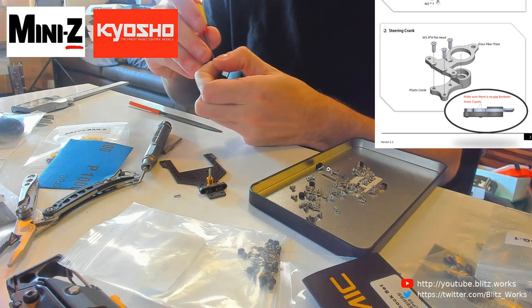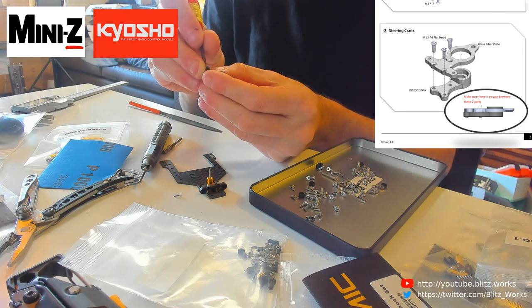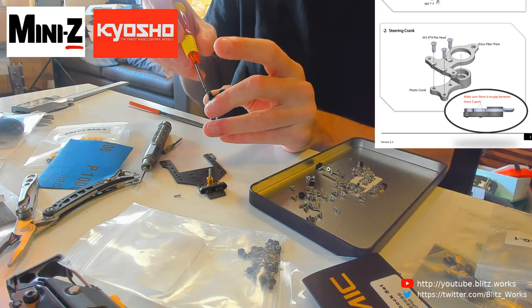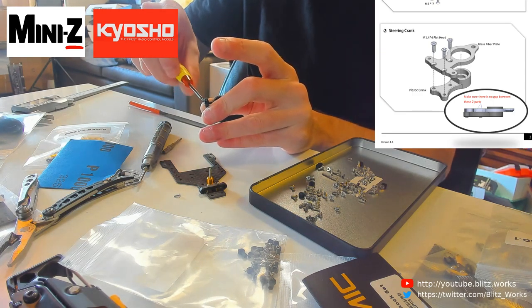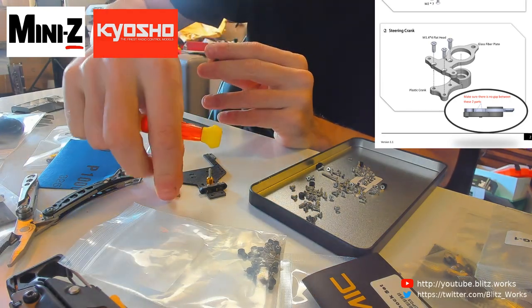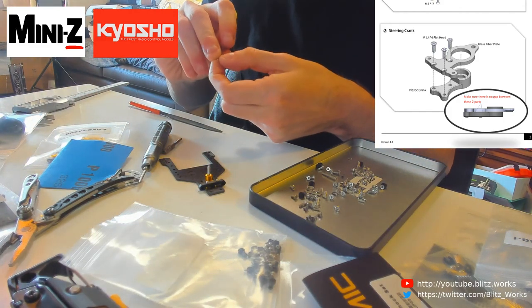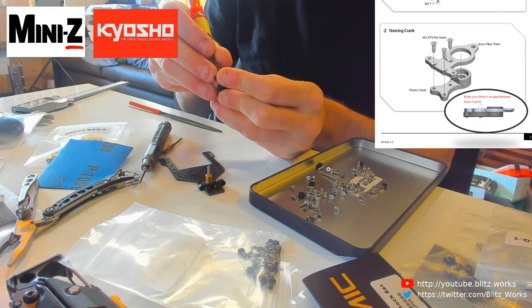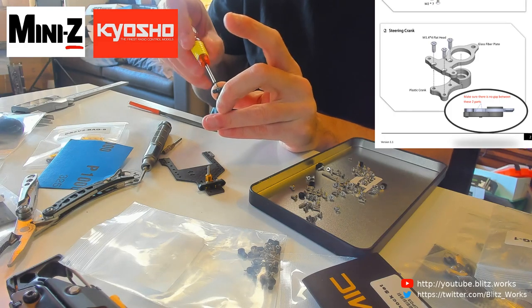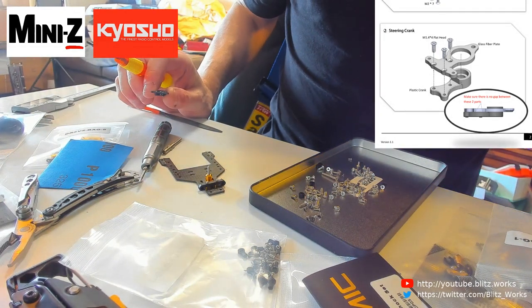Yeah, so you shouldn't be mixing things like 5mm length and 6mm length because they're too close to tell apart. You want to be at least 2mm apart, and you only want to have a limited amount of different threads. Ideally, you want one sized thread, possibly two max. So like an ultra fine pitch, for example, and a normal-ish pitch, just so that you can quite easily get all the screws you need. And custom parts are bad parts every single time because they're normally the most fragile. Custom screws, for example, you lose one and they normally only provide one and you're stuffed. And I'm actually working on top of carpet at the moment, which is somewhat dangerous. Let's pull that out. Cool.